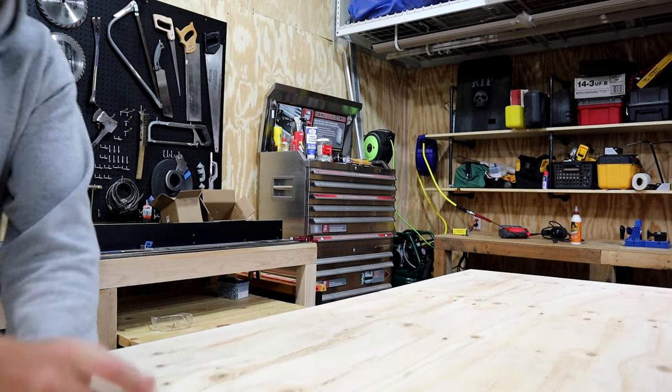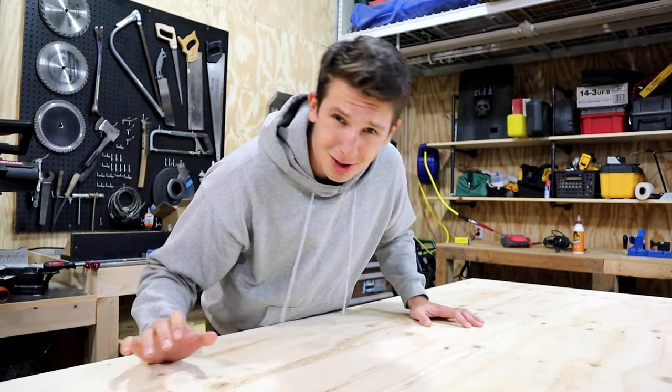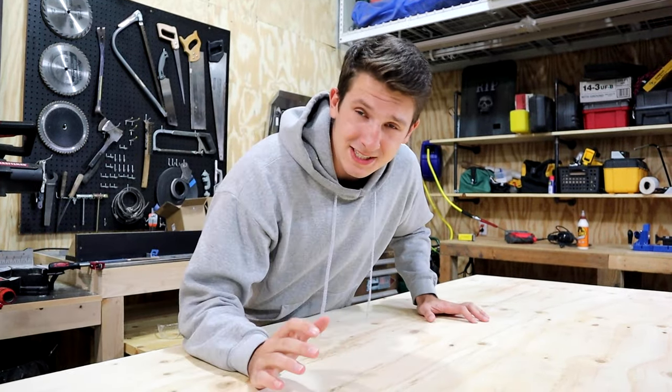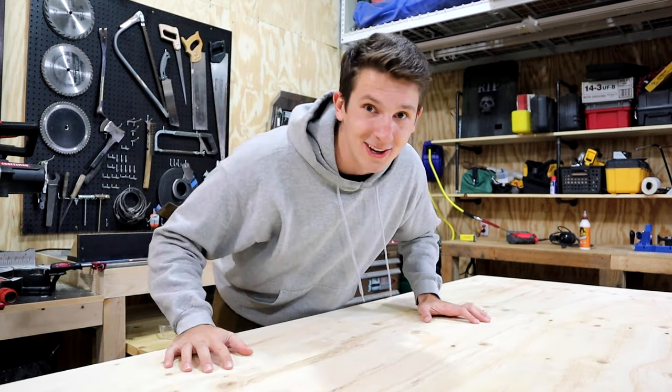I really want my tabletop to be rock solid with no flexing, so I'm going to be using two layers of three-quarter inch plywood. But I also really want my table to look good, so my top layer is going to be a birch veneer plywood — that way it gives it a really nice clean look after I'm done with it. So I've got my base layer here. I'm going to load this up with glue, put my top layer on that, and then clamp the heck out of it. I'm going to bring in a second pair of hands for loading the glue because I've got a lot of surface area to cover.